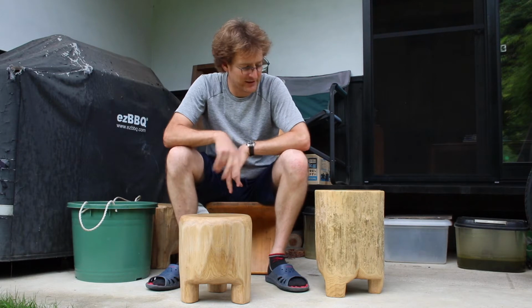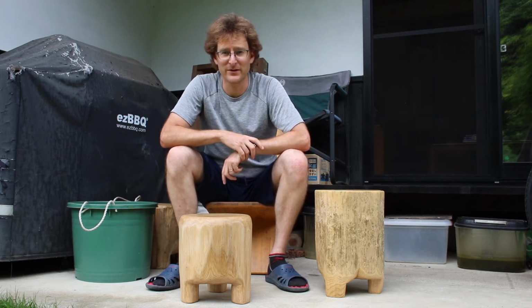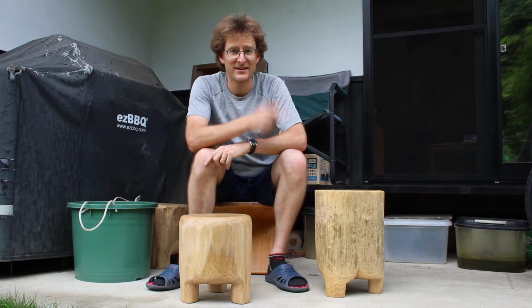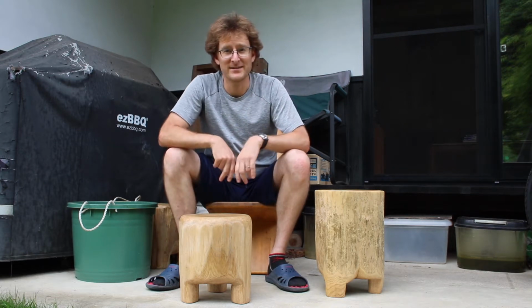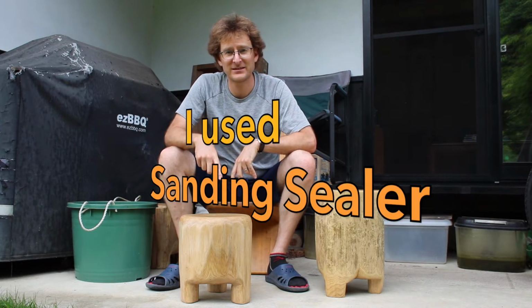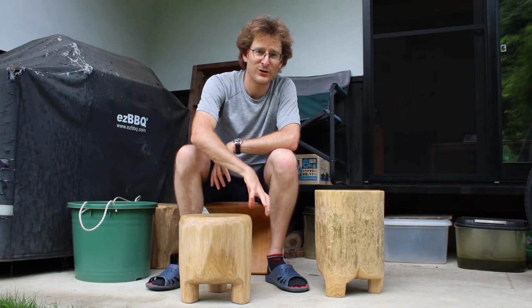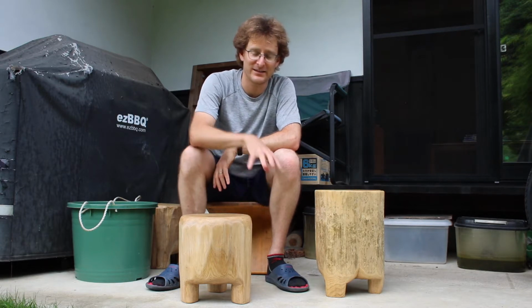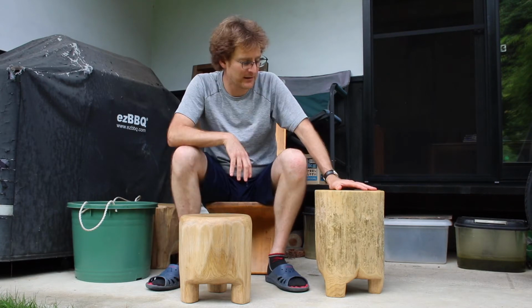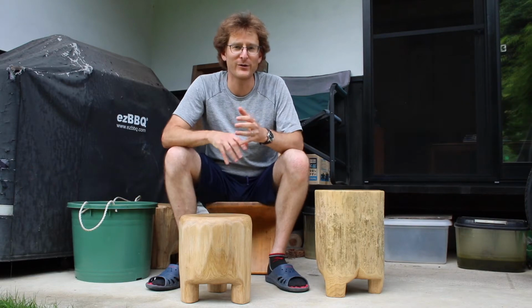I spent a lot of energy in these and they were really fun projects. But they are also learning experiences. And I made a mistake on that one, and I made the same mistake on this one. What mistake? The sealer I used on this closed up all the pores, so that it's unable to breathe naturally. Then after that, I compounded my problem by putting on an oil-based polyurethane.